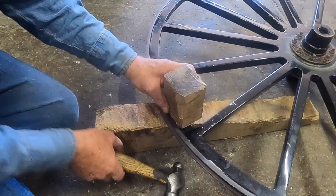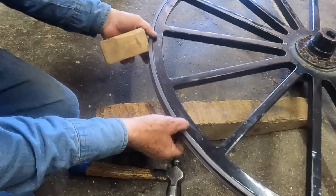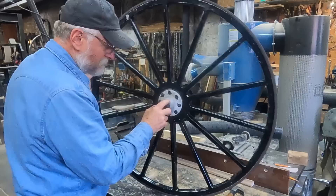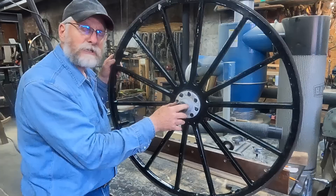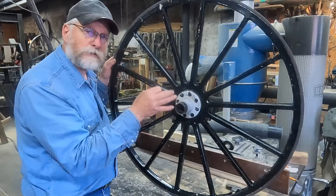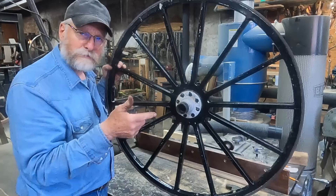Just go around and kind of push it into place. Sometimes you have to go back and forth and kind of work it in. This tapered block kind of works as my anvil underneath to help the tire stay in place, then I can push this fiberglass into where it needs to be. Where I had stated previously that shrinking the tires was pretty much the same as a wood wheel, there are a few subtle differences. I do handle the fiberglass a little more carefully — it's probably a little more brittle. It doesn't take as much tension, so it doesn't take as much heat to expand the tire. And this channel iron cools off fairly quickly, so it's kind of a really quick process. Maybe those are some of the subtle differences that will answer some of the questions that came up in that last comment section. Hope that helps. Appreciate you following along.